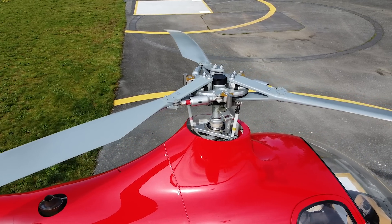From a noise perspective, three blades produce more of a humming sound rather than the whap-whap of a two-bladed system. You also get a performance increase — more blades distribute weight better, so you can typically haul more with a three-bladed rotor system. As helicopters get bigger, manufacturers often add more blades — going into five- or six-bladed systems for medium and heavy helicopters.